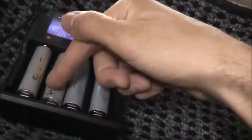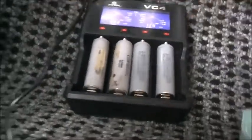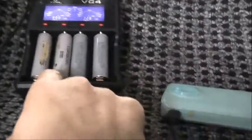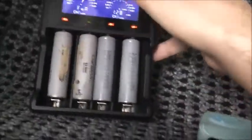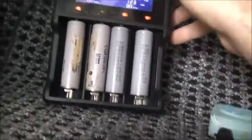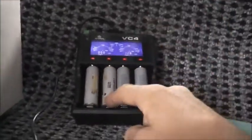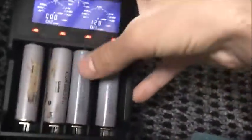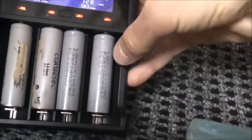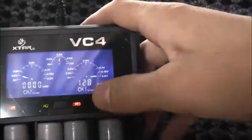And now with this one here, when I pulled the tab off it I cracked the bottom of it, so it leaked. I just cleaned it up and re-soldered the hole just to stop it from leaking, but I think that might be too far gone as a result. It's leaked a little bit of its electrolyte, which is why it's not willing to charge anymore. Had that hole not been there from when I ripped the tab off, it might have been actually saveable. But these batteries have actually come out quite well — they wouldn't pass a charge even though they had voltage, the charger wouldn't even charge them. I did the same trick with those and they're working fine now.